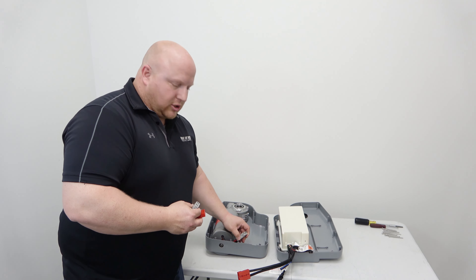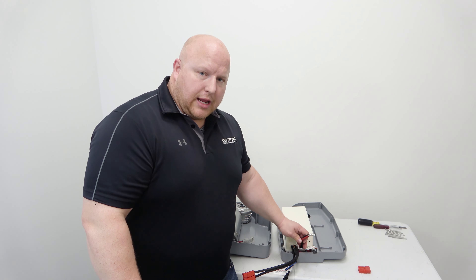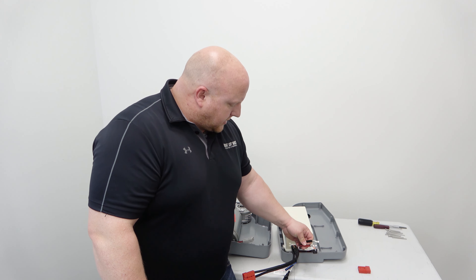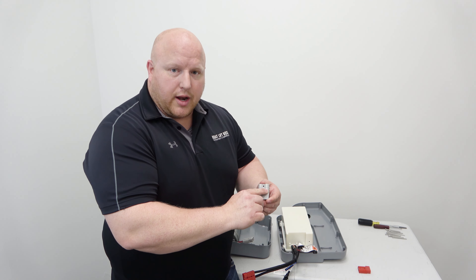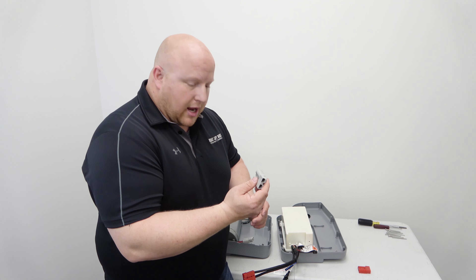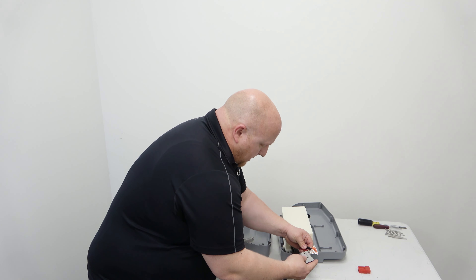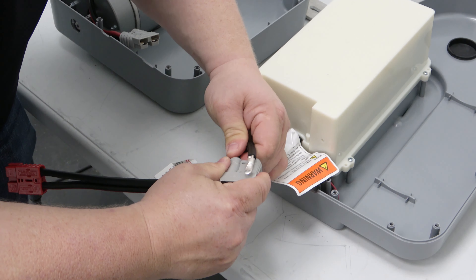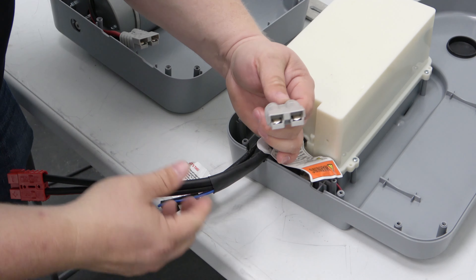So you can determine what connector you actually need to add to your short lead. On the short lead from the electronics module you'll find one wire that's all black for your negative, and one lead that's got black and red for your positive. On those you just have to match up the positive and the negative on your new connector — it's very simple. Take your connector, determine which positive or negative lead you have. I have the red, which is my positive, with my positive here and I slide it in. You can hear it click. Give a good pull and make sure it's connected properly. Now take your negative and do the same — clicked in, give it a good pull, and now you're ready to go.